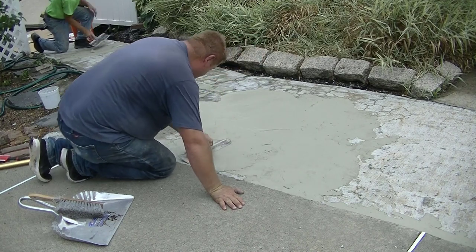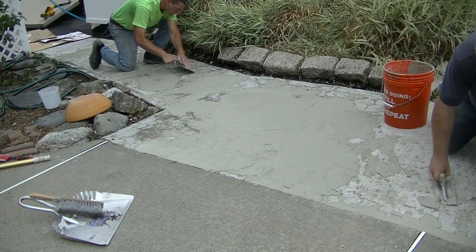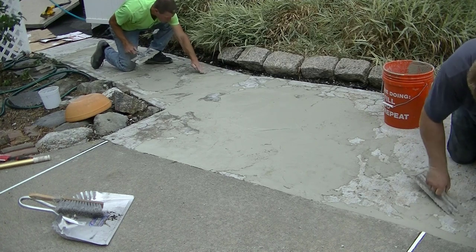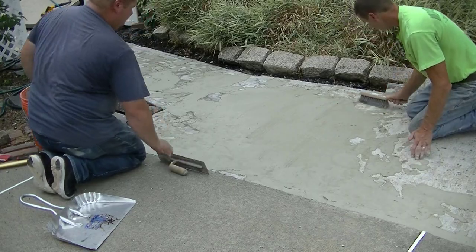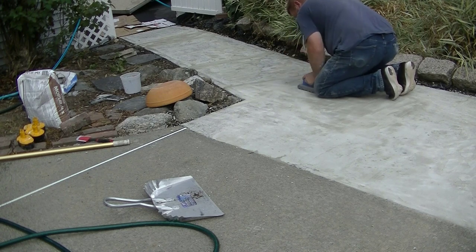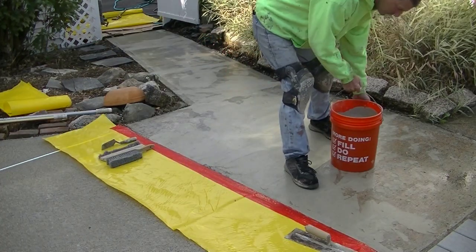So this was the process that Luke and I went through: grinding it, prepping it, patching it, and then resurfacing it. We put a light broom finish on it for some texture. We're going to coat it with our waterproofing coating — I use that on pool decks, patios, anything with foot traffic. I don't use that waterproofing coating on driveways where you're going to drive over it, but it holds up really good. I've had it on a basketball court for about eight years. So all the spalls were fixed, all the little pop-outs, the chips, the divots, the cracks — they were all fixed.